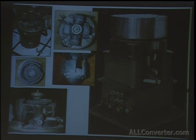Broadly, the instruments are divided into two classes, and this article has first a section of eight instruments which have mechanical make and breaks, or circuit controllers, and the second class has mercury interrupters. And it's basically a liquid form of make and break. And the idea of mercury interrupters were used before, but mainly for induction coils and for special types of X-ray machines.